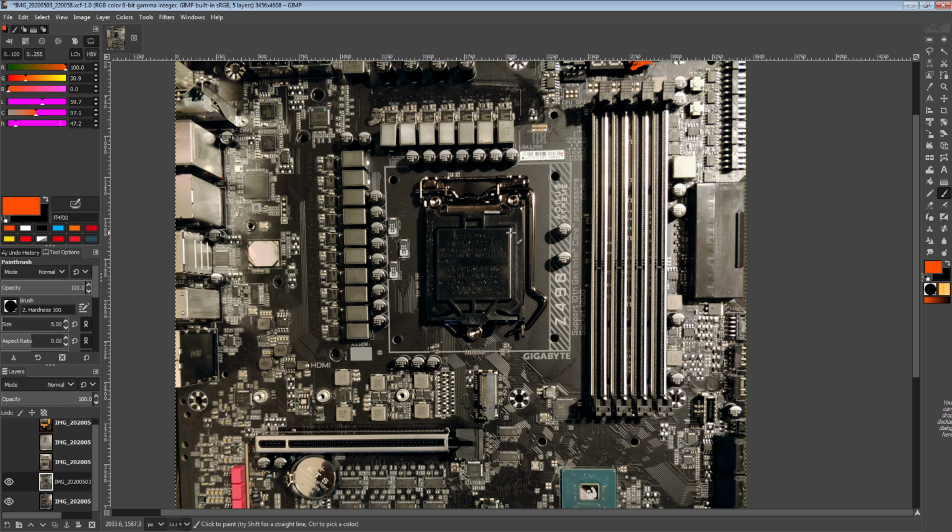But like the rest of the board vendors, you punch in bad settings, and especially on the Intel platforms, they will get stuck in a boot loop basically forever, or potentially just get stuck on one postcode, and they won't even loop. They'll just get stuck on a postcode and stay there forever. Which is really annoying because the board won't recover from any kind of failed overclock. On some generations it's better with some vendors, but generally it's terrible. And Gigabyte generally is not great about this. So basically, this is the kind of board where you're going to be doing a lot of save profile, fail to post, clear CMOS, load profiles, start over. So exactly the kind of scenario where a safe boot button is most useful.